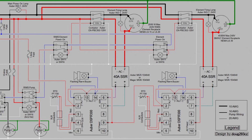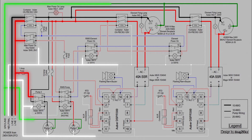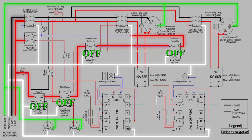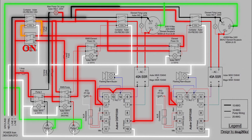That rounds out all the components for the system. When the power to the panel is turned on, the circuit flows through to the main contactor switch — and I'm exaggerating the diagram with all switches on to prove a point about the loop. When the first pump switch is turned off, the circuit flows to the second switch, then to the third, then the fourth. When the fourth switch is off, it flows to the main switch, makes contact on the other side of the main contactor switch, and when the main contactor switch is thrown, it turns everything else on.